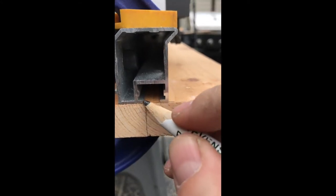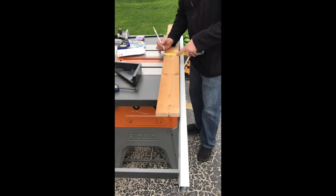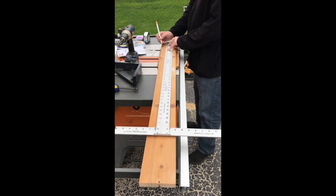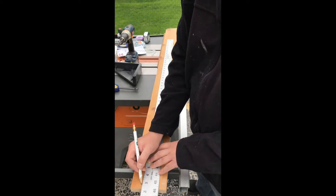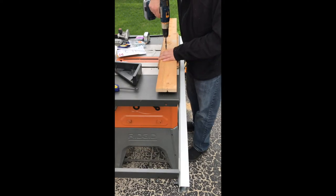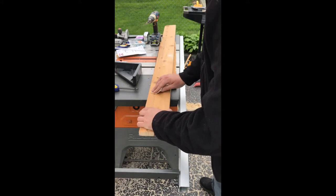Once I knew that measurement I was able to carry it down along the support piece. Since this was a lot of scraps and probably not completely square, I took extra time when making my marks to make sure things lined up as well as possible. Once my line was scribed, I made marks at about every four inches — this denotes where I want to drill through for the hex bolts. I then drilled through; there's no need to countersink anything because everything attaches from underneath.